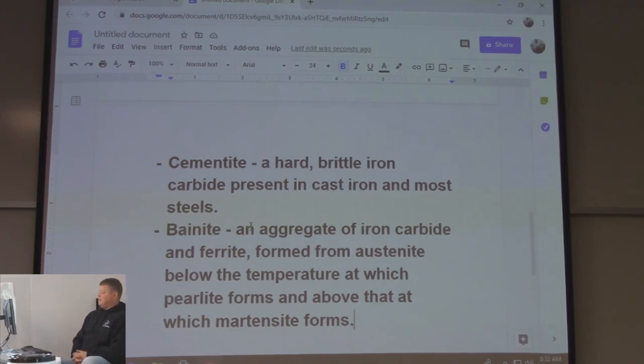I would assume that maybe bainite would be a mistake, or maybe you didn't quench it fast enough, or in the correct media. The media is basically, did you quench it in water, air, oil, furnace, refrigeration box? There's all kinds of stuff. That's what they were doing for the DOT test. You're not allowed to quench the plates when you weld them. And I go over there, there's a guy with an air compressor just blowing on it. I'm like, that's quenching it, man. What do you mean? It's not going in water. I said, there's air hardening steels, man. I go, that's quenching it. When you're blowing air on it, you're cooling it faster than it's supposed to cool. Right?